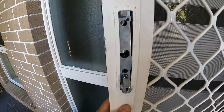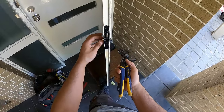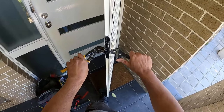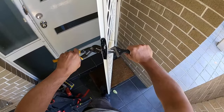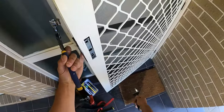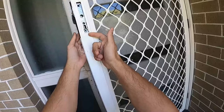So to remove this one here, what we need is either two adjustable wrenches or two multi-grips. The face is already off so we've got plenty of access on either side. All you need to do is bite on one side like this, do the same on the other side, get a nice good grip, and then simply push it out and then back in — it's going to snap one way and then we'll snap it the other way. You can hear that one there is snapped, and now both sides are out.